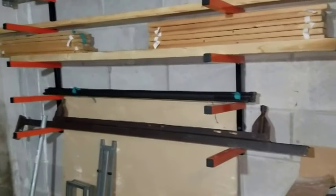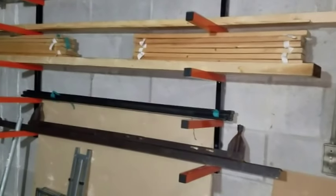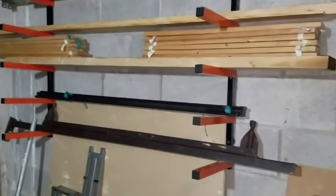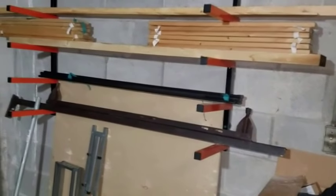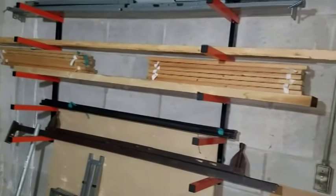They've got a rod going up there — we're gonna have to wire in a light correctly. Let me get to that and I'll be back after a while. Alright, I went ahead and put it up over here on the back wall instead of the wall I was originally looking at. I didn't like the cracks in the wall and didn't want to stress it since it's part of the foundation. I'm just gonna fill it up with concrete — I talked to several structural engineers and they said just pour concrete down, because a lot of times that's code even now. The top is open so I can just pour concrete — it'll probably take about four bags for two columns to strengthen the wall.